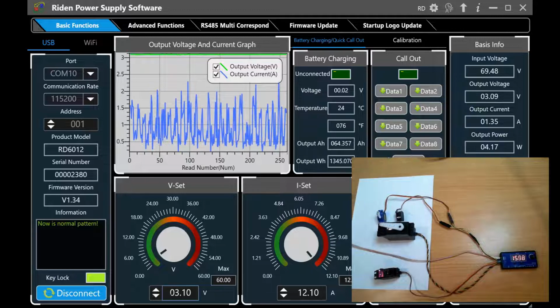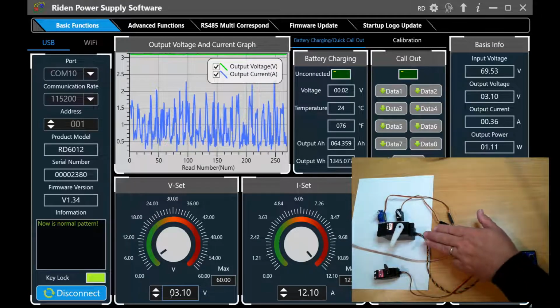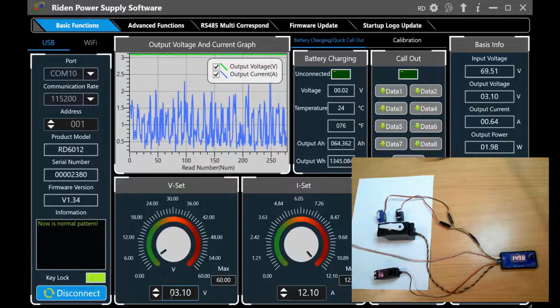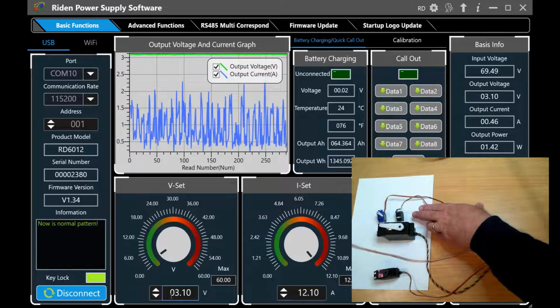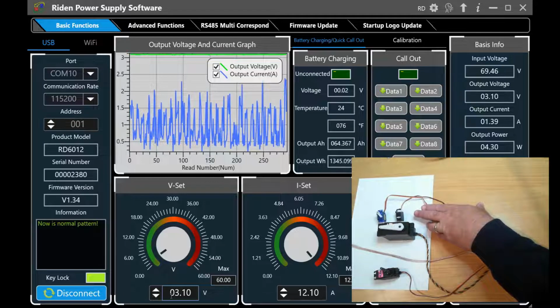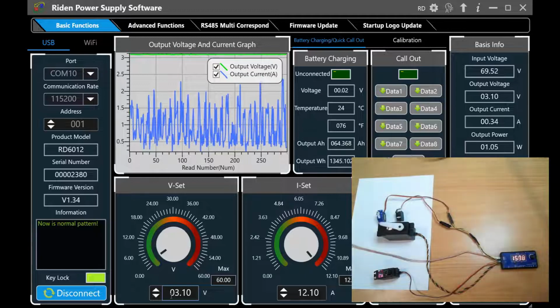So you can see here that the servos are not doing too well, although this big giant servo, which is the HiTEC HS-805BB, that's the dual ball bearing commonly used in the InMoov robot, is actually doing a lot better than I would have expected. The little tiny PDI 1109 is actually doing very well as well at that voltage, and this is well below their rated voltage. Don't get me wrong on that.